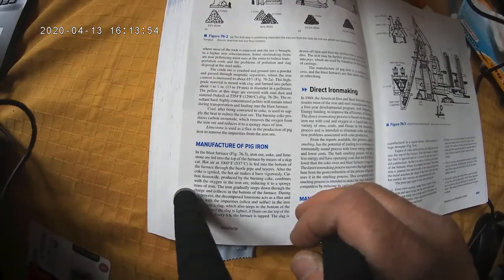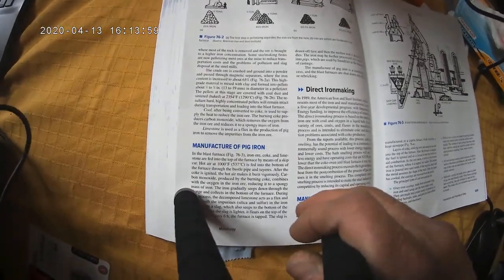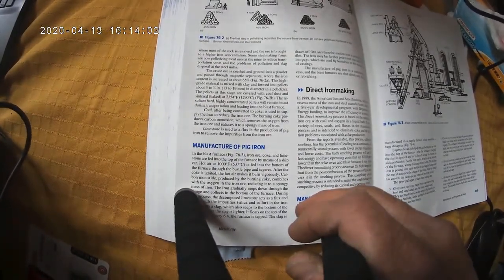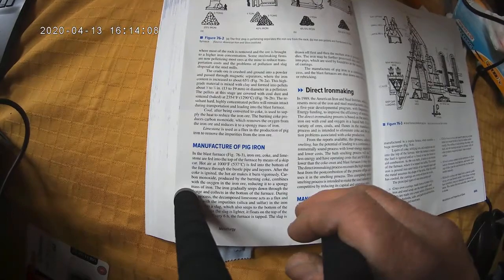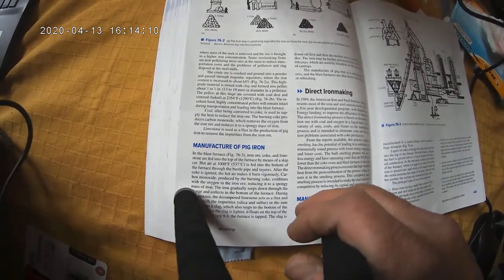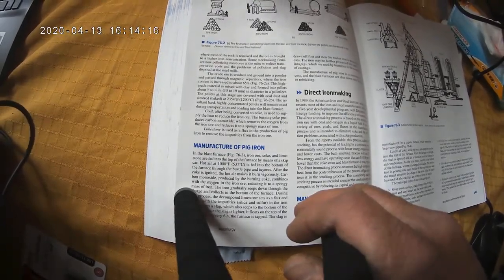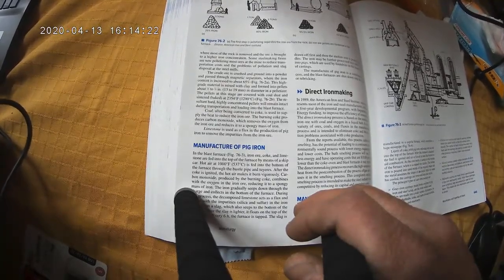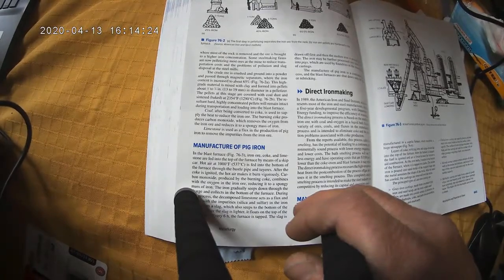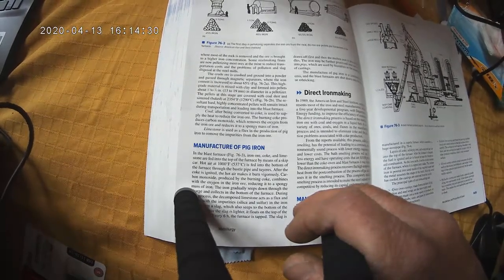The crushed ore is passed through magnetic separators, I should say. The iron content is increased to about 65%. The high-grade material is mixed with clay and formed into pellets about 1/2 inch to 3/4 inch in diameter in a pelletizer. The pellets at this stage are covered with coal dust and sintered or baked at about 2354 degrees Fahrenheit. The resulting hard, highly concentrated pellets will remain intact during transportation and loading into the blast furnace.